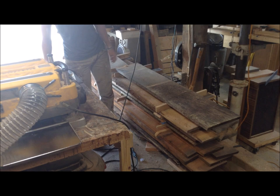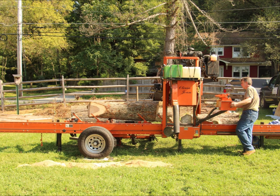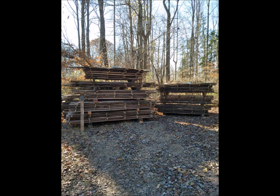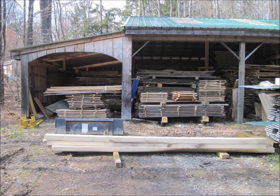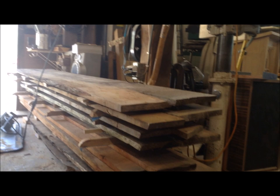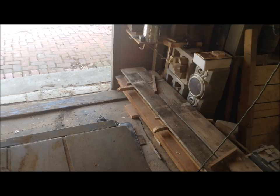This lumber I got about a week ago. I didn't bring a camera when I went to the lumber yard, but this is Greg with his portable sawmill. When I go to this place, he has a bunch of huge outbuildings and just stacks of lumber everywhere. He keeps most of his lumber outside. So when I buy from him, I have to bring it back to my shop — even though my shop is an outdoor shop with no temperature control — and stack and stick it and let it sit there for at least a week to acclimate. I have it stacked based on when I'm using the pieces: the cherry's on bottom, the maple and oak are on top. Most of the cherry he had in his shop, so it has some dirt on it.